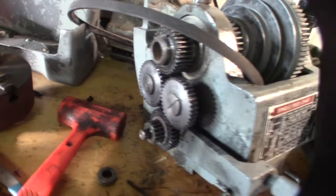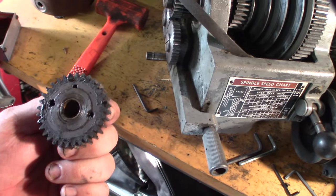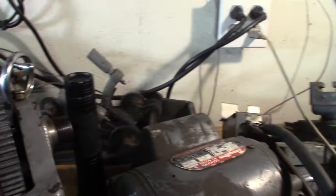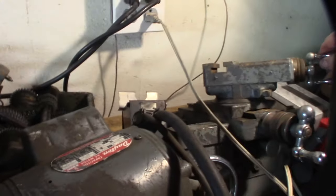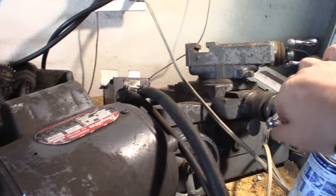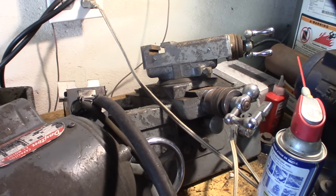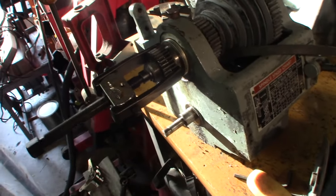I think it's kind of already marred up, so I'm just going to put all this stuff in a bin for ultrasonic cleaning. Whatever oil the guy used in there - hopefully not grease. Like all the ways, you can hardly move them - super tacky. The tailstock is really hard to turn. This one could just be the gibs are too tight, but even when I was moving the saddle back and forth it was pretty hard.